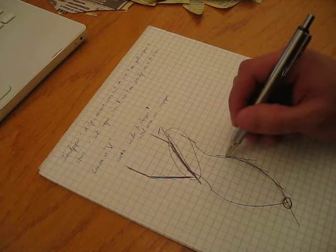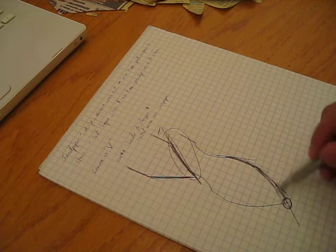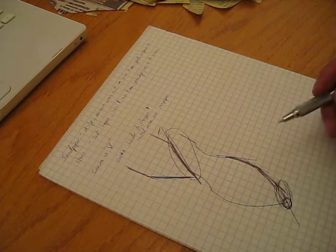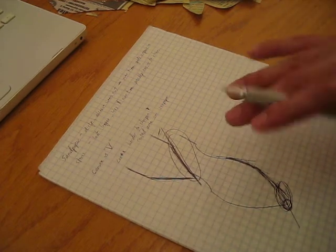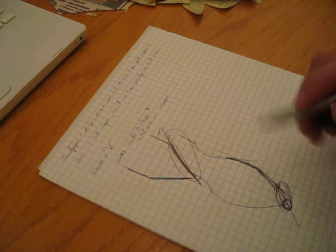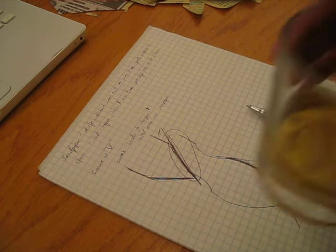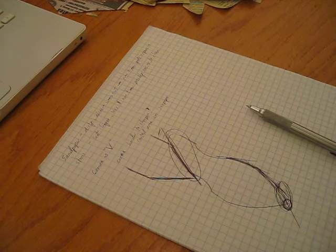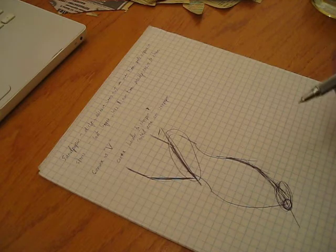If you highlight with Sharpie, if you're doing it right, only the Sharpie in the very tip part should be removed — you shouldn't be touching the upper area because it's round. Theoretically. Obviously small convex edges on a soft backing will conform — hence you get the convex. But because this rocks more, you have to focus more and be more precise to hit the edge. So convex edges might not be the best idea for beginners — not because someone can't learn quick, but because if you're not getting good results, you might get discouraged.